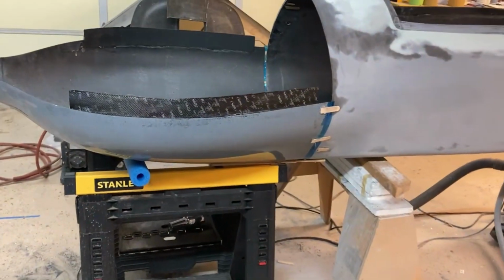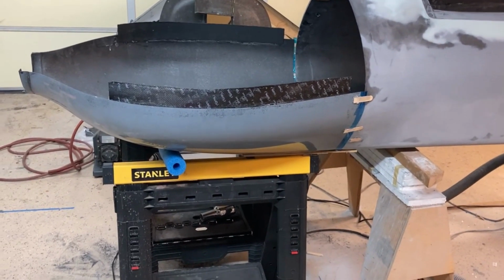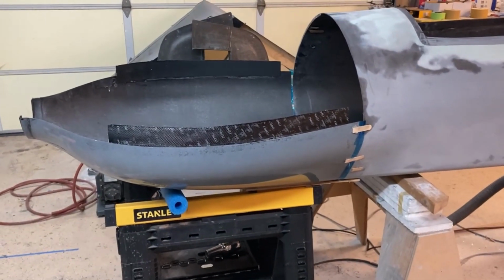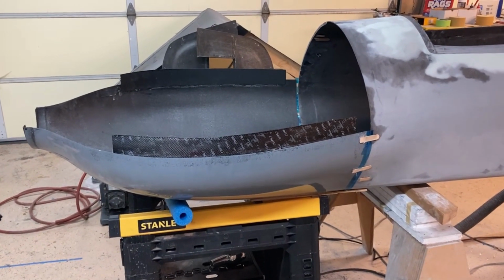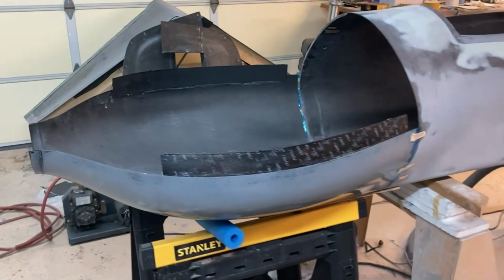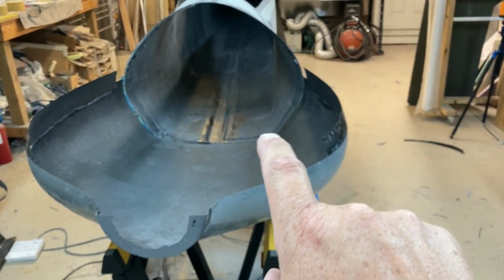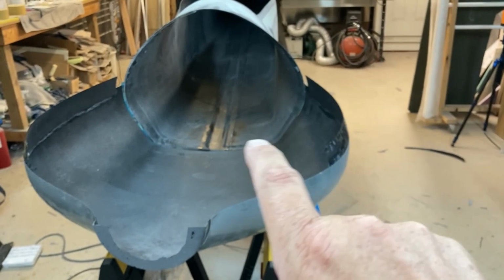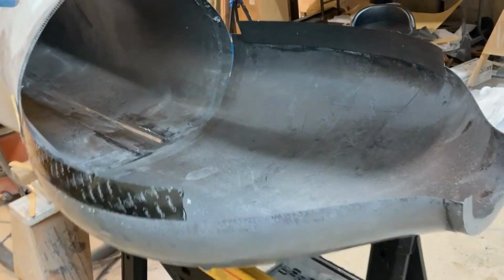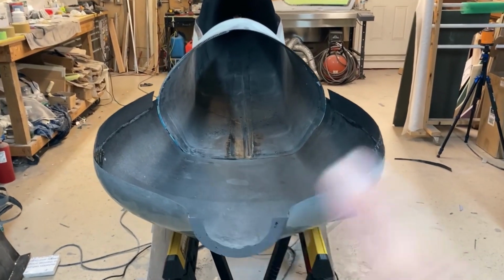but that's what it took to get it straight. And I guess truth be told, I've had the cowl on and off of here 4 times, you know, completely fixtured up like this, and I didn't like it, so I took it off and redid it. I'm being a little picky, but that's because this is pretty important that I want this made it up there just perfect. So I'm gonna have a little bit of extra work to fill that gap, but yeah, that's really no big deal. I can get most of it filled initially when I put in a mixture of resin and cabo in there before the carbon goes down. So you can sort of see there. The biggest challenge actually was getting it completely straight this way. So I've taken the laser down now, but I used the laser to get that all nice and straight.